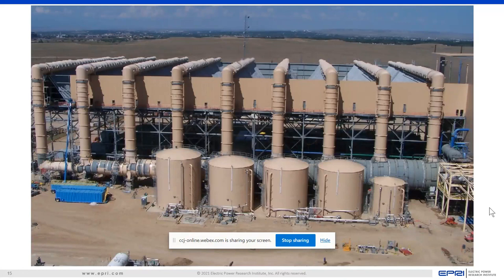Getting access to flexible joints on the riser tubes is difficult. In this example there are something like 20,000 fin tubes, which means 40,000 welded connections — a lot of potential for leaks. Generally we see more air coming into an air-cooled condenser than with water-cooled condensers, simply because there are so many places and it's so difficult to pin them down.